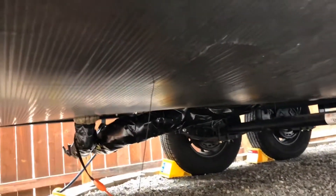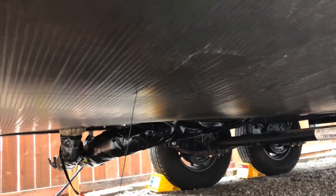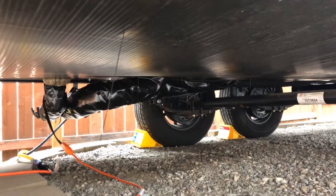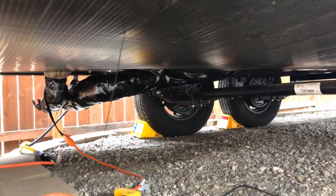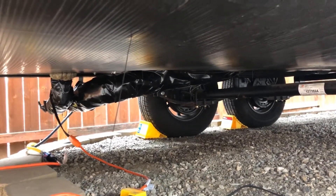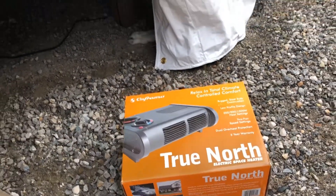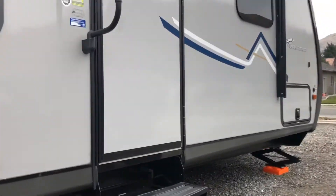I also put another L-shaped slit right here for a thermometer, so I have a thermometer up in there monitoring the heat so I can keep track. Over there we have the pipes coming down for the tank dumps, and I wrapped those in heat tape and a little bit of insulation to keep them from freezing. I'll put a link for the heater in the description, and then I'll go inside and show you what we have going on.